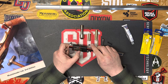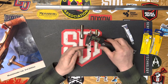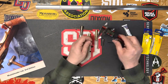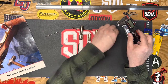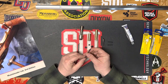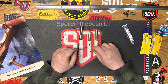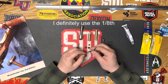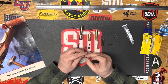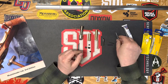Basically what I did was go through in millimeters, just measuring until I found the one that was close and matched. This drill bit is for wood, not metal. I think it'll go through this cast just fine. If it doesn't, I'll switch to this 1/8-inch drill bit, which is slightly larger but should handle the steel. That'll still allow me to do the pins. So if all you have is a 1/8-inch, I think you're going to be fine too.